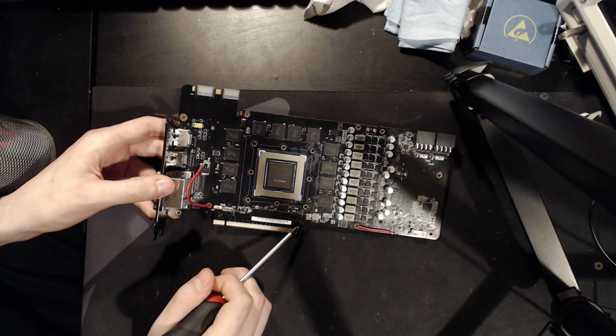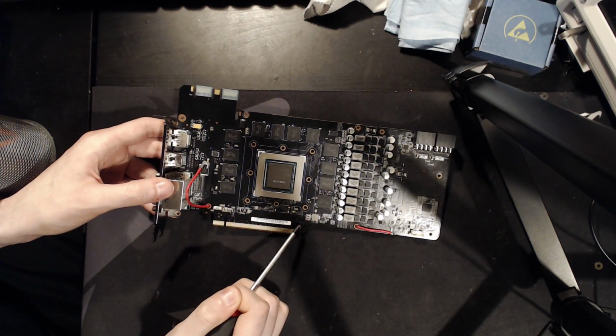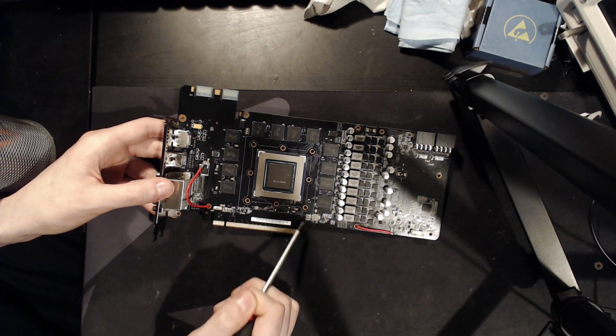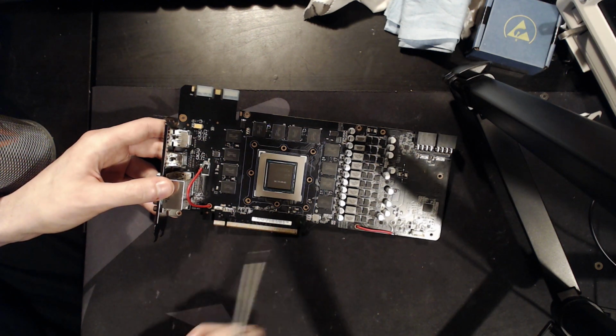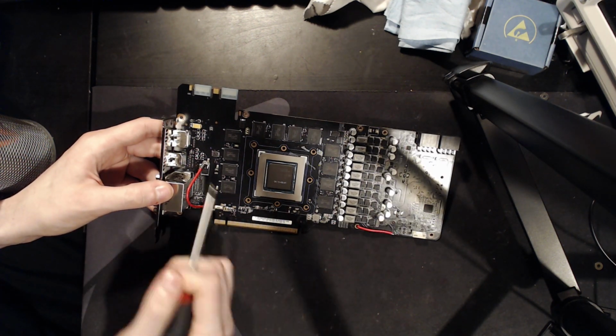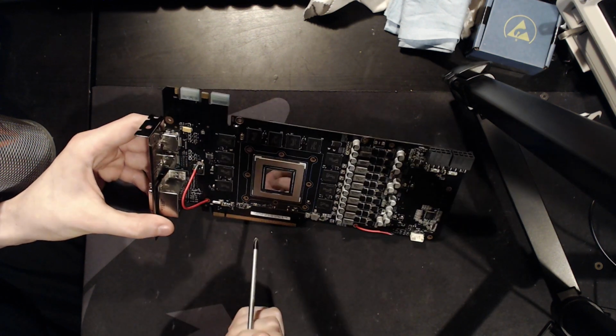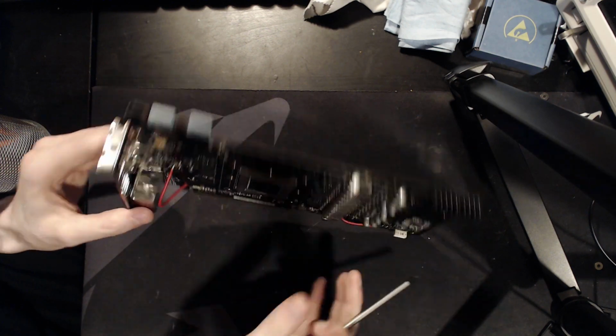And would you know it, the output pin of that thing is shorted to a voltage read point on that power plane that's cut right around here. So at that point, it was a simple matter of choosing a convenient place to put a wire and run 5 volts through a wire to there. So that's what this big red wire is for.